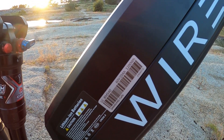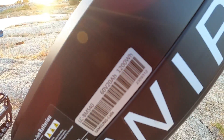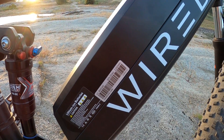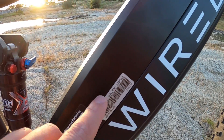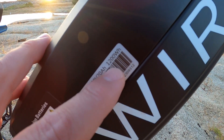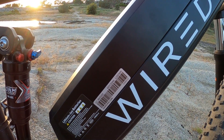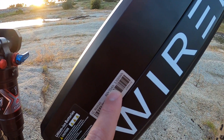Think of amp hours as the storage — basically how many gallons you can fit in a gas car's gas tank. That's what 20 amp hours represents in the electric world. The higher the amp hours, the more capacity, more range, and more energy you can store in the battery. You might also see a number like 1200 watt hours printed on the side. Watt hours is a more specific storage number: 20 amp hours at 60 volts, multiplied together, gives you 1200 watt hours.